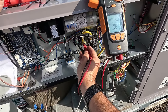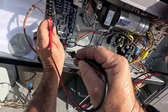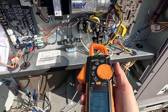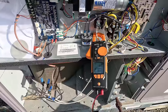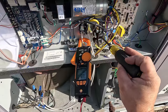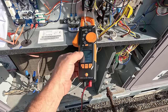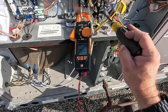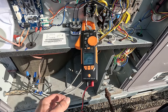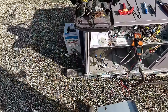Our incoming is 244 volts — you can see it takes a little bit of time to read it. Let's go up here and go R to common: 27.01 — I'm good with that. Let's go ahead and go on to amps. Let's go ahead and jump this thing to see if it trips the breaker, or better yet, we could probably just push this contactor in. Fancy Nancy. It took forever for it to read it. Let's go ahead and turn on in-rush — push it in: 172 amps on in-rush. So you wonder why the 30 or 40 amp fuse is tripping — there's a reason why, plus I short cycled it, which would cause it to be higher.